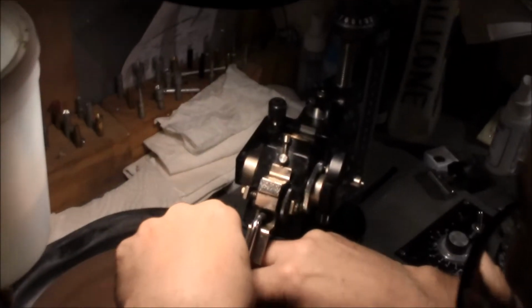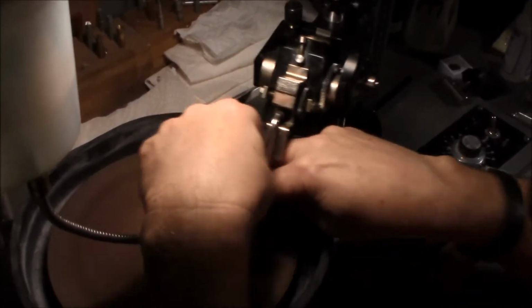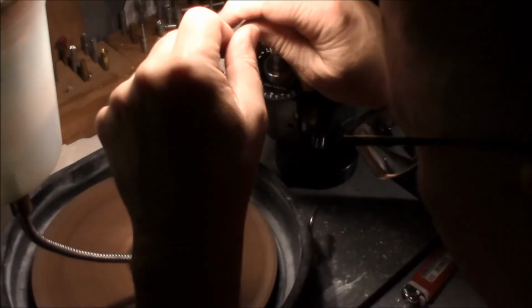So, when it was taking me an hour to cut and polish a pavilion, it was taking them 4.5 to 5 hours. I learned really quickly, and they did as well, that they were not putting enough pressure on it, and they were not cutting as quick as they could. So now they are cutting about 4 to 5 stones for every one they used to. So you really need to watch somebody do this, because you can read all the books in the world, and until you watch someone do it, you will not get the full grasp of it.